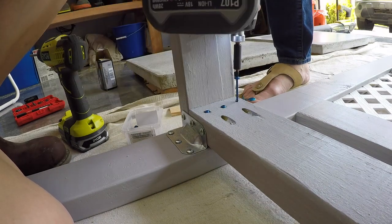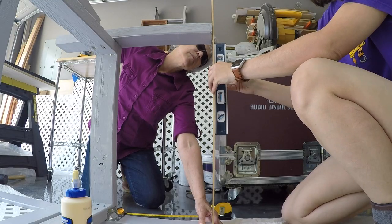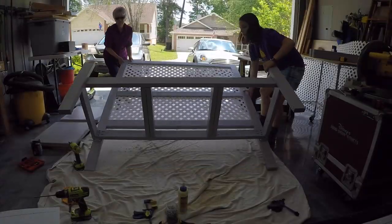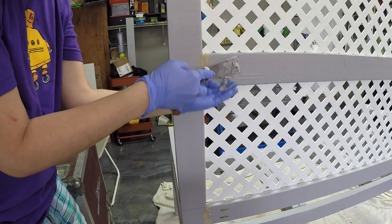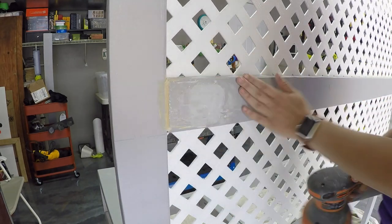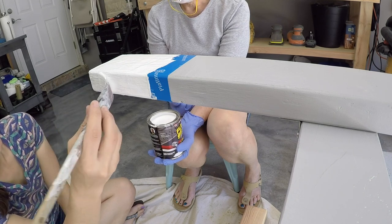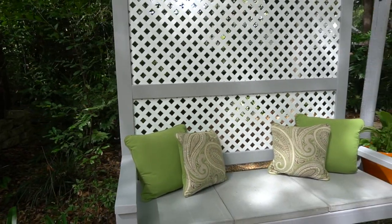We wanted to make sure the weight of the concrete was not an issue for this bench. We attached the front legs by leveling them with the bottom legs, then glued and screwed everything into place. We raised the bench and filled the back pocket holes with Bondo and sanded once dry. The four feet we covered with Flex Seal, which is a paintable rubber — we thought this would add extra protection to where the bench meets the ground. Once everything was dry, we brought it to the backyard and added the three concrete slab seats.